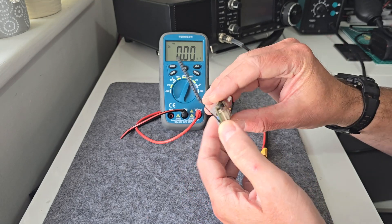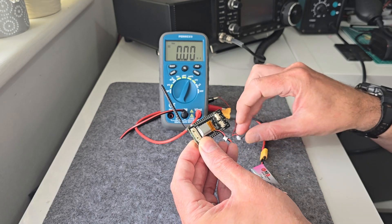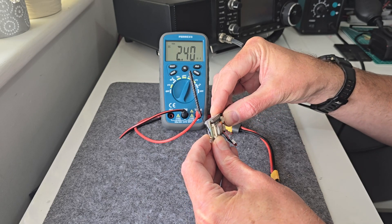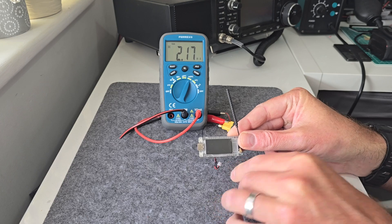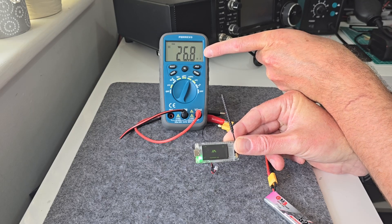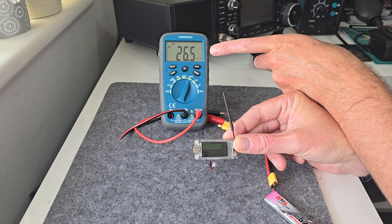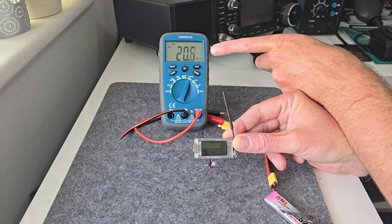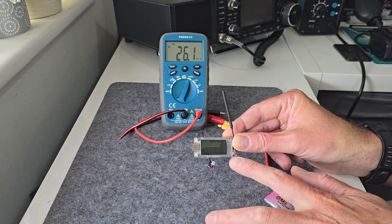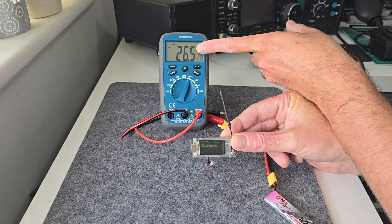So I've unplugged the little battery on the back of the T114 because we want to be powering it from this one. Plugging this in carefully — these are super little flimsy connectors. It's starting to boot up. You can see 2 milliamps here and then it's going to go up quite high for a little while as the device boots up. This one isn't connected by Bluetooth to my phone, and it hasn't got Wi-Fi turned on, so it's just straight up as it is. You should see some transmissions happening as the radio goes into transmit.